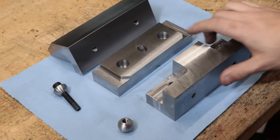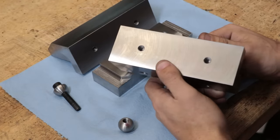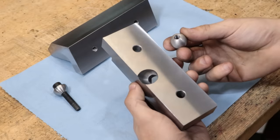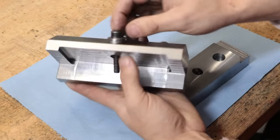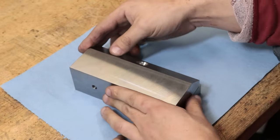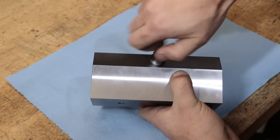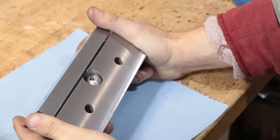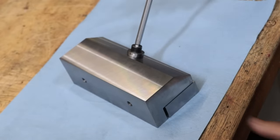And that is the main parts of the vise now done. All in all it actually looks really nice. So let's get it all assembled and see if it works. The ball sits down in the recess that we cut on the bottom and the screw will pull the top jaw forwards and downwards. In effect this will create the clamping action, but it will also make sure that the jaw doesn't lift — because the jaw is being pulled down into the workpiece. I still would have preferred to use a proper pin rather than a ball, but I think for a vise this size it will still work. The rough texture left on the ball means there's enough bite on it so that it doesn't just spin in the socket.